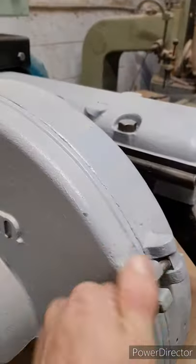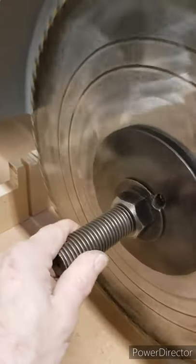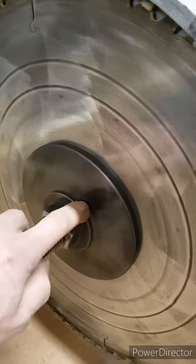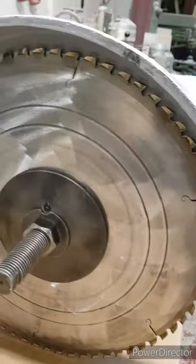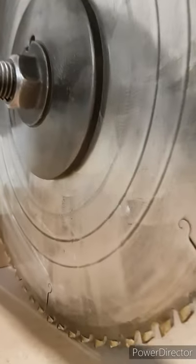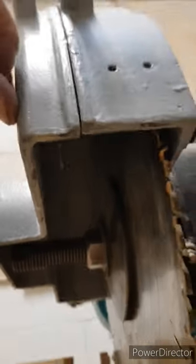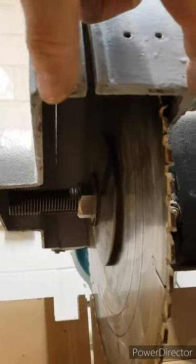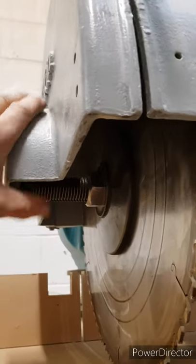So we'll open it up. An inch and a quarter, so you can put some big stuff in. It's got its peg hole in. So when you put your disc in, if you're doing a lot of hardwood stuff, you don't want your disc spinning on the shaft, because it'll either wear your blade out or it'll cut a groove into your shaft and then all's buggered. But yeah, this gap, you see, you've got the thickness of your blade and then the distance in there, that's how thick you can have a trenching head. So it's brilliant, absolutely bloody brilliant.